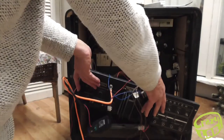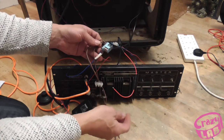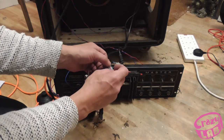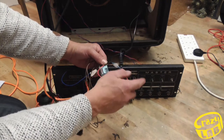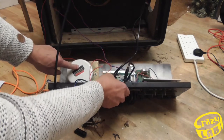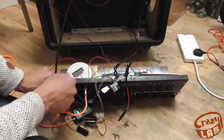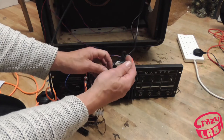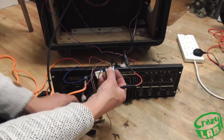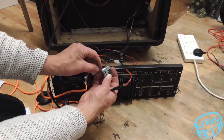If you're going to add a Leslie onto an amp, you need to be aware of a few things. That's the relay switch — I've got a fuse on that coming from the transformer. It's a 240-volt transformer but it runs four different voltages, one of them being 110. On the primary coil I've taken the tap off to get 110 volts via that fuse to the relay switch, and then that coil runs 240 volts down to 12 volts. There's a little diode on there just to stop the back EMF.